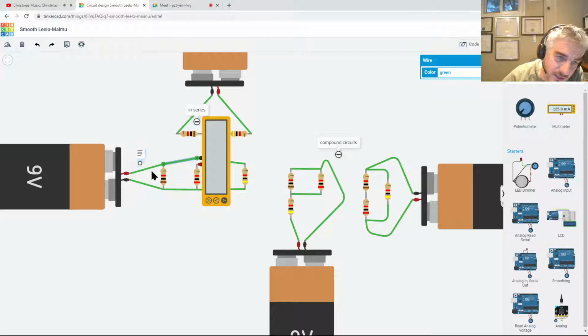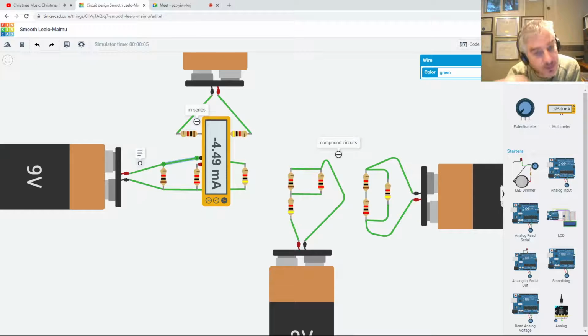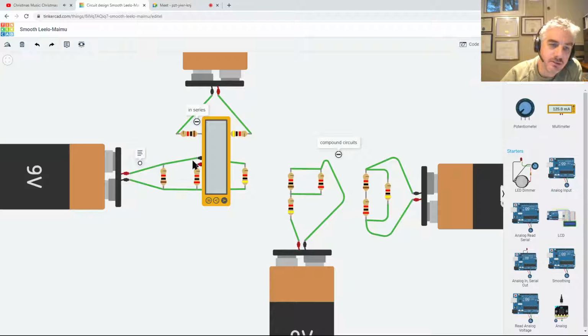Basically, this wire is going straight to the two resistors here, right in behind, but I'm interrupting the flow to R2 here. So this should give me another reading. Perfect, so 449. You record that for parallel. Okay, so that works. And then you do the same for R1.